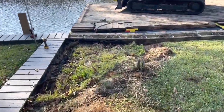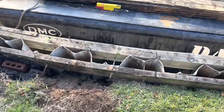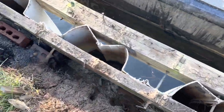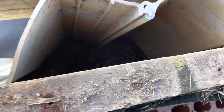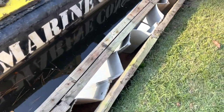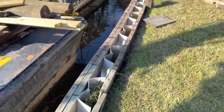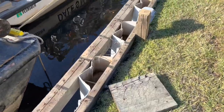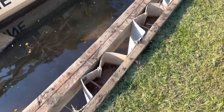After removing the cap, we're trying to figure out why just this one section of wall was bowed out, and then we hear water running and see there's a stream of water coming down here. You can see it down in the corrugations just flowing. It's washed out all behind this wall. We followed the source of it and it looks like the neighbor might have a broken water line over here — it's causing all this to wash down to the weakest point of the seawall and start sucking dirt out.